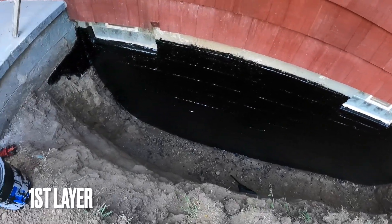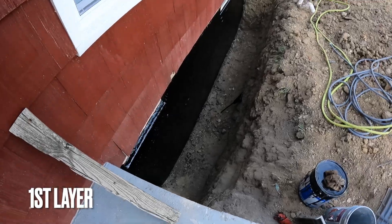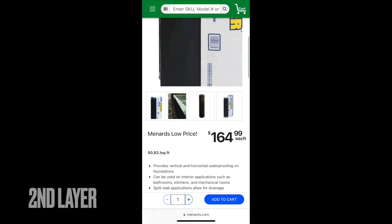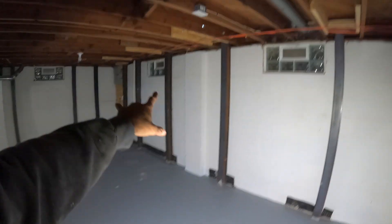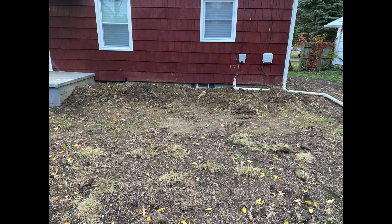I think I deleted all of the final clips, but basically the first coat is the tar — I tar the wall and let that dry for normally one to two days. This is the foundation coating I normally use; I get all these products from Menards. The second layer is a peel-and-stick self-adhesive membrane, and then I use dimple board, which I normally just attach in a few spots across the top with tapcons. Here's a look at the wall all done on the inside — I think it turned out pretty good. Can't complain. This one did not go very smooth but it is what it is. The house is done. The next video will be the before and after of this property, and that will wrap up this series. Thanks for watching.